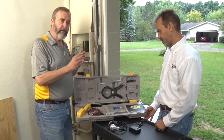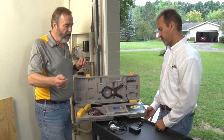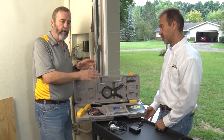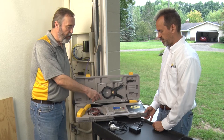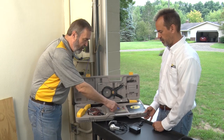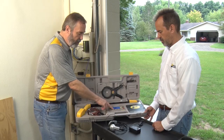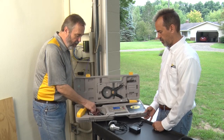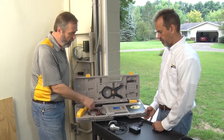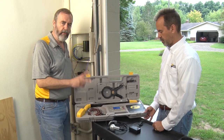Pattern is an interesting function. We made it so you can either have a tracing signal that goes beep-beep-beep or have a steady tone — more like a metal detector. As you sweep over the wire, you get stronger signals instead of stronger beeping. Those are just a few things you can set in here, and some are interesting and important like the pattern. When you're done, you hit Back and you're at the main menu. If I want to go to conventional direct clip-on mode, I'm at a screen that lets me use the clips and the ground stake to do clip-on locating.